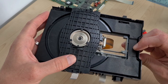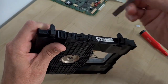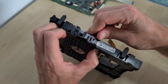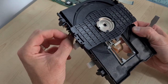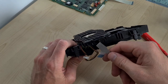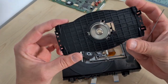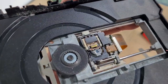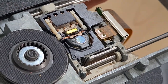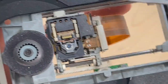Discard the cage and there's one semi-normal looking CD transport. We'll remove this black plastic shroud off the top — it's just clipped into place — to reveal the laser. I'm going to pop these clips with the spudger hopefully without breaking one. I hate working on plastic transports. The laser itself — if I try to catch the reflection — is definitely manky, you can see the dust on it. And as you can see all the dust down here on the wheels and the rails needs cleaning up.